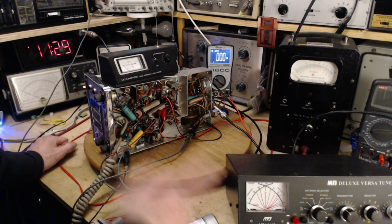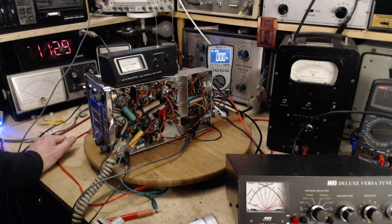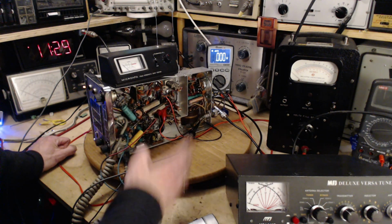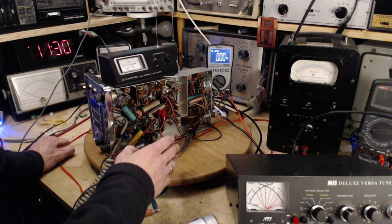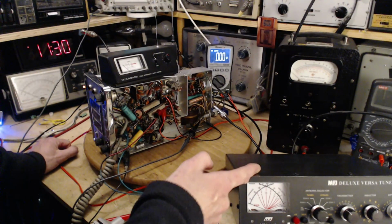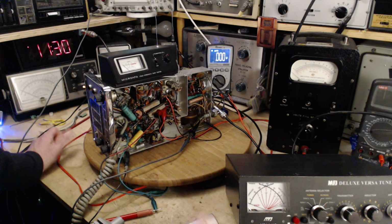We also, just to go a little further, have a couple of different ways of monitoring the output power level coming out of this transmitter while I'm adjusting it. So it looks like what I can do is fiddle up the power while monitoring the PA current, the plate current, and see what happens. We can see where we can go. I can kind of set it to the 22 or so, and we'll see how much power we're putting out of that, because I can calculate it from the voltage measurement and the resistor. And then we can fiddle around a little more and just see where we can get to, maybe with 30 milliamps of current in the output tube.